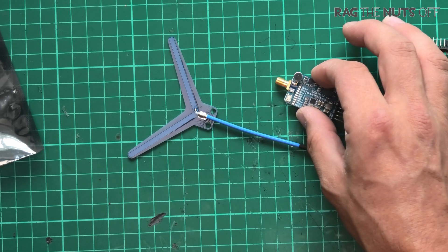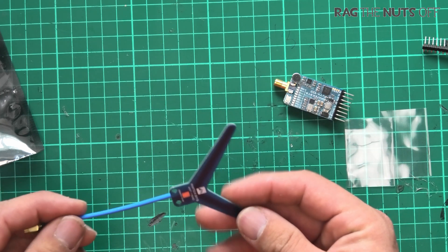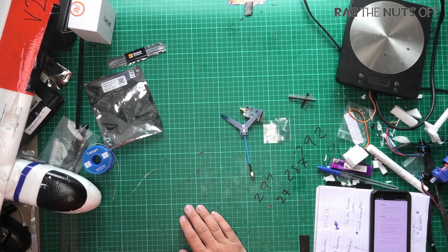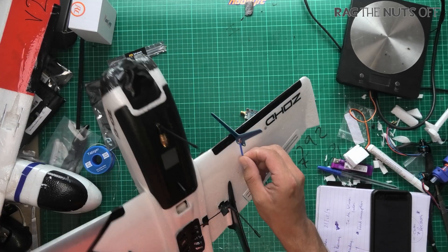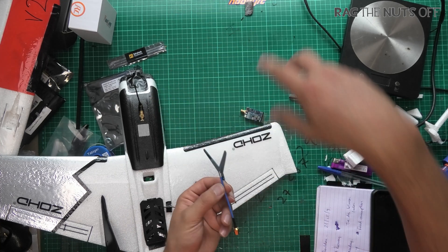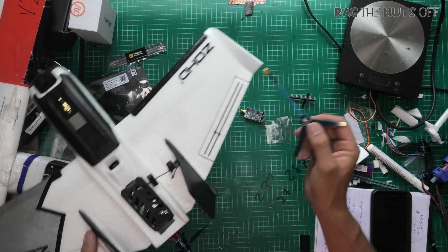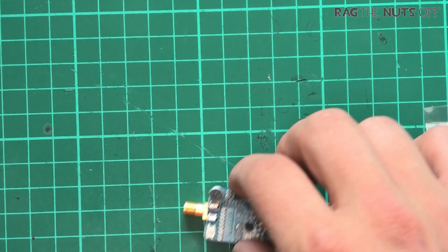The real oddity is this V antenna, and I found a lot of confusion with it. In short, this V piece should ideally be pointing towards you — so if this was on an aircraft, you would typically have that pointing towards the front of the aircraft on the model's return to get the best signal. The V creates a mushroom pattern going out like that. I'll be honest, when I've used this antenna I had it reversed going the opposite way because I didn't really care about the journey on the way back.